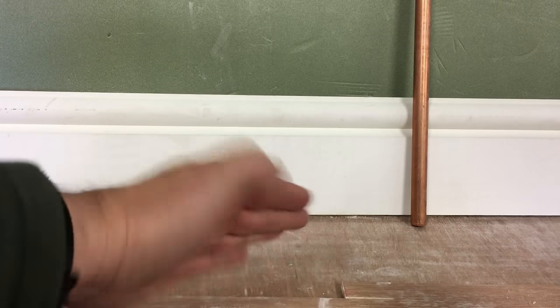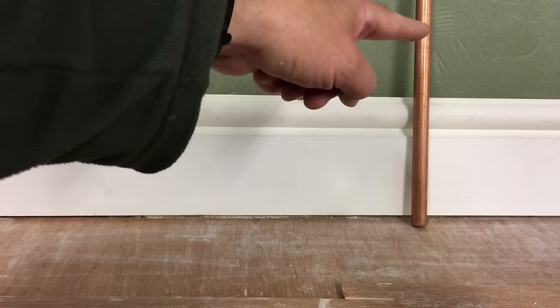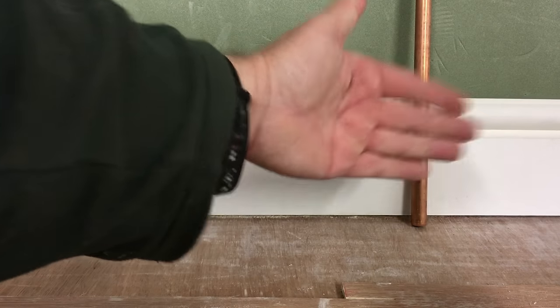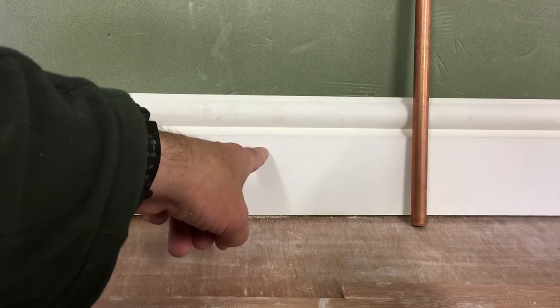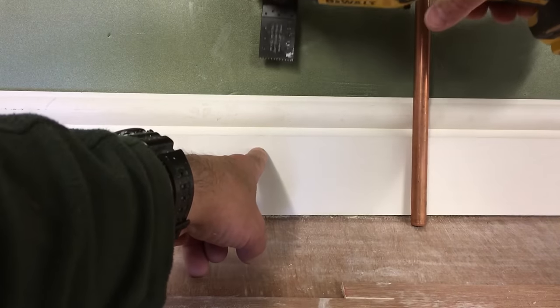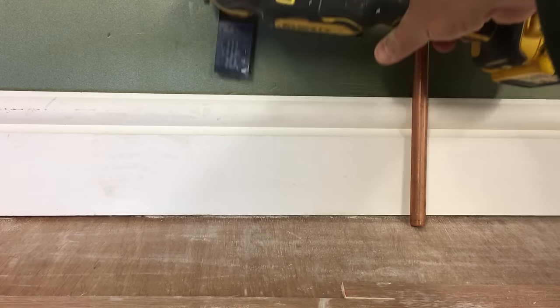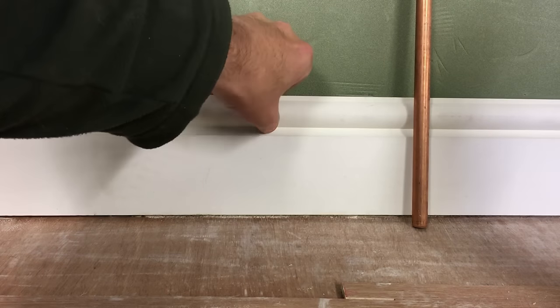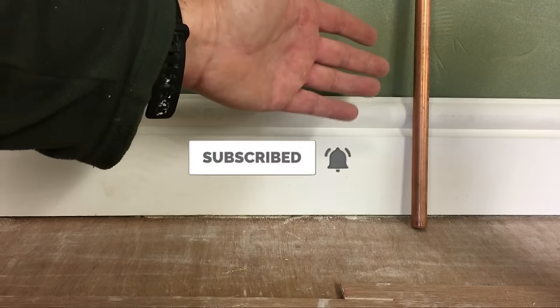Another use I've found this tool extremely useful for is when you're doing laminate flooring or vinyl flooring and you need to get the skirting boards off to create a neat finish. A lot of the time the pipes are hard against the skirting boards — I'm replicating a radiator pipe here — so you can't get them prised off to get the flooring and the nails out. What I would use this tool for is get the blade on, put it at an angle, slip it down behind the skirting board and just cut the nail. Once that's cut, you can lift the skirting board up without having to take it out, so you don't need to mess about with the plumbing or the heating system.